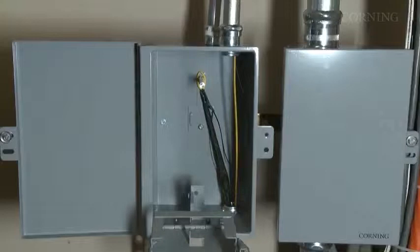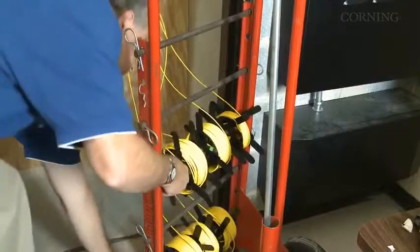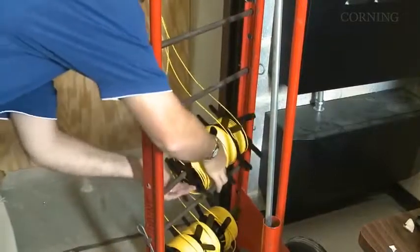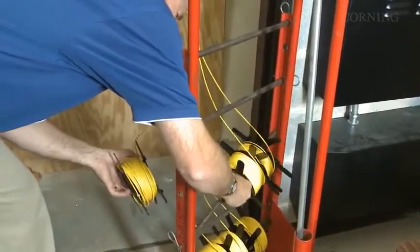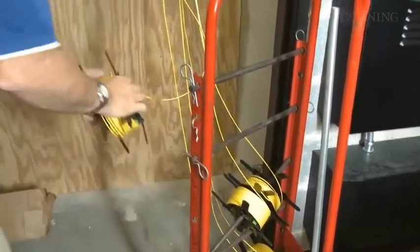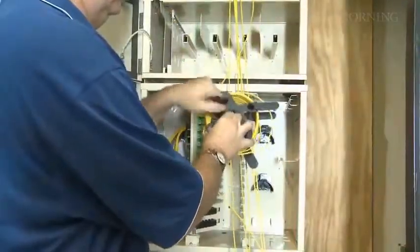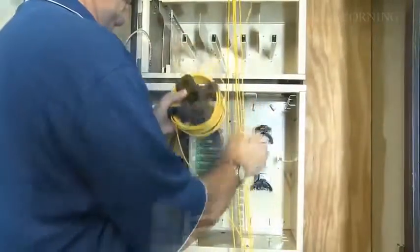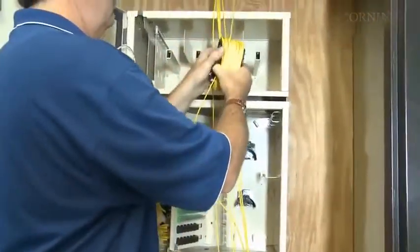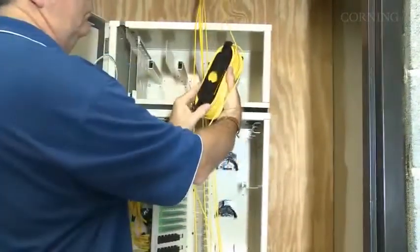Complete pulling and connecting or storing a cable on all remaining floors. Back at the CE cabinet, begin removing the reels to attach and store. Find and pull out the MTP connector with its small length of cable. Remove the eight exterior tabs from the collapsible reel by flexing them back and forth until they break off. Once the tabs are removed, collapse the reel as shown until it is small enough to fit into your storage cabinet.